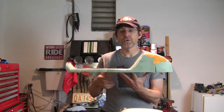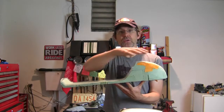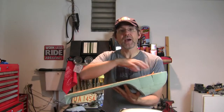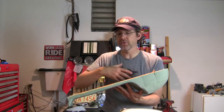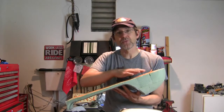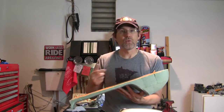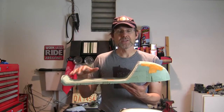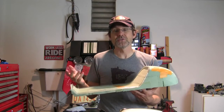Let me explain myself a little bit. When you're doing this, you've got a couple of different choices. You can take your foam — this is a mold — and cover it with fiberglass. Then when you pop all of this foam out of it, you'll have a shell. You can flip that upside down and clean the inside of that shell and get that perfectly smooth. You can build it up and reinforce it with additional layers of fiberglass and resin. And then when that is absolutely smooth inside, you can over and over use that as a mold to build additional seat pans that are all exactly the same. Or you can take the approach I'm doing, which is the fiberglass that I put on this foam will be my seat pan, and I'm only building one — so essentially I'm just using the fiberglass mold as the seat pan.